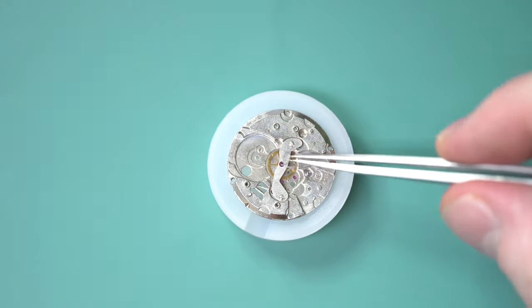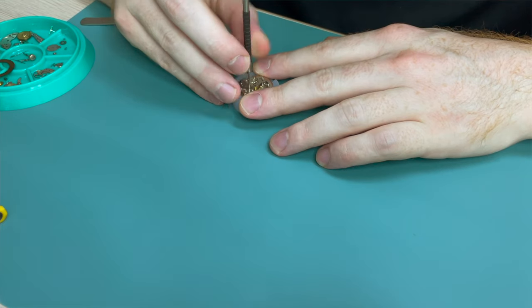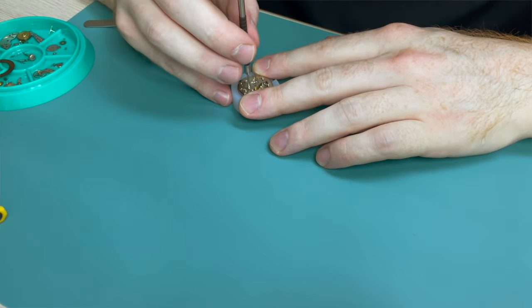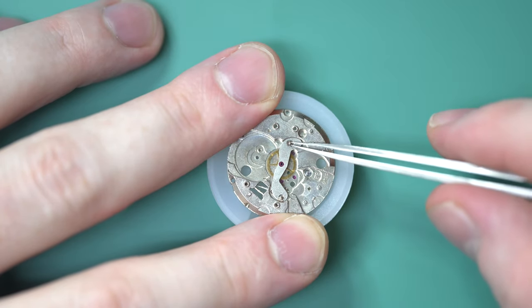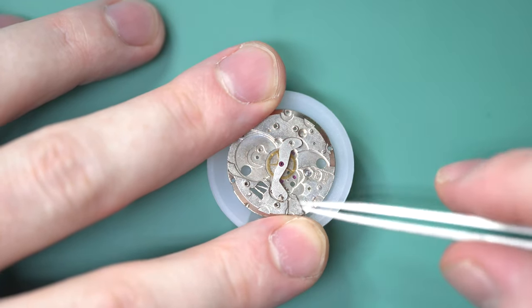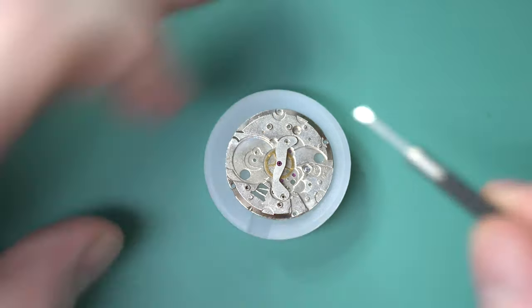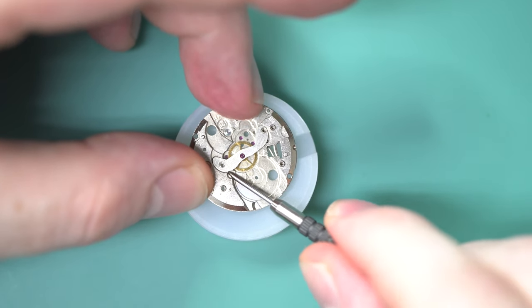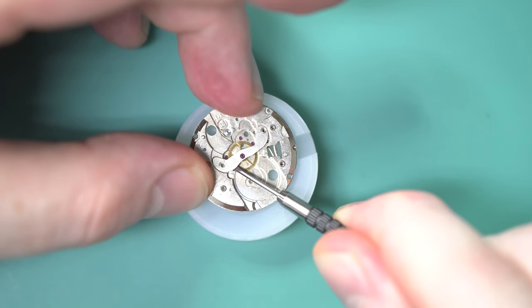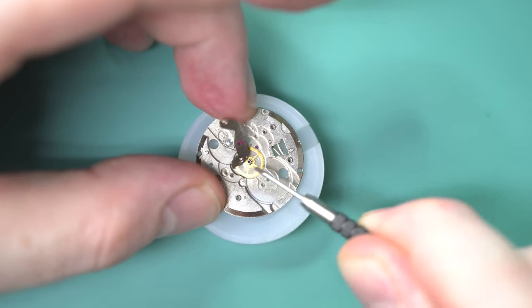So them four wheels, they transfer from when you manually wind the watch up and store the energy in the main barrel. So you could call that the first wheel. Then when the energy is released, it goes from the main barrel to the second wheel to the third wheel to the escape wheel. It's that transfer and reduction in rotation speed throughout them, that train, that governs how the watch runs and how quick each hand should rotate.